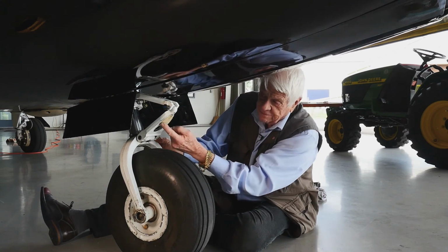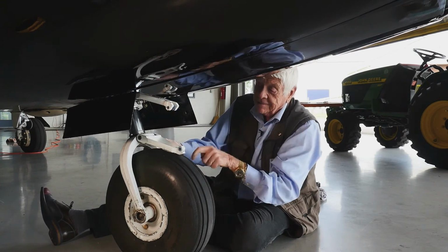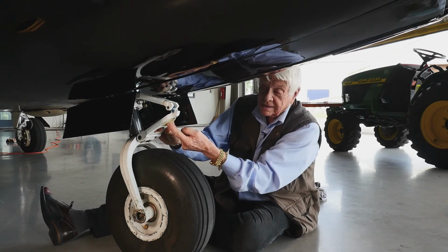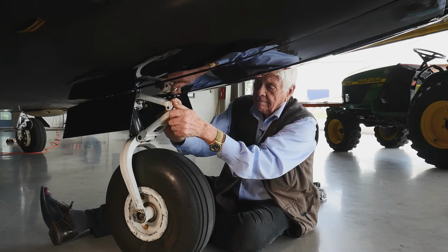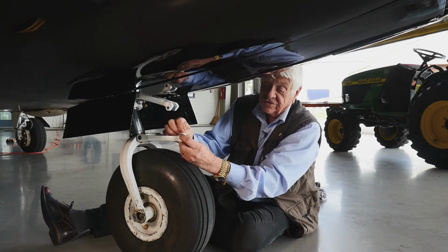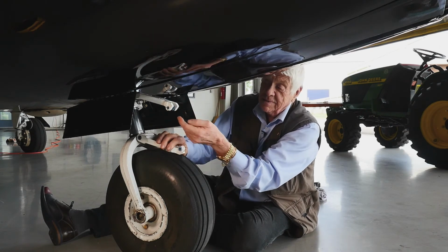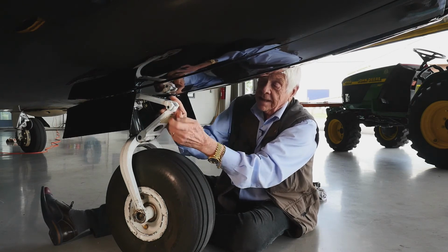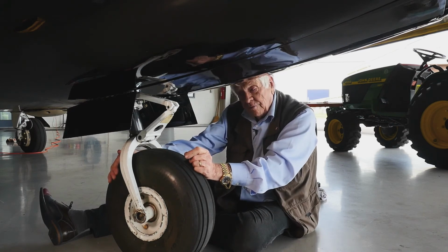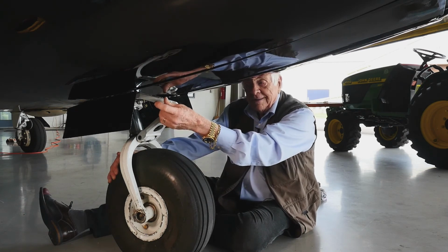Now we put a pad of Thor tape on the bottom link here, because when this bottom link falls down, it's going to run on the tire. This basically prevents the tire from wearing the bottom torque link. We've actually made these bushings as long as possible. We made them longer than the OEM ones. Of course, you've only got a certain amount of space there, but that's so we have the maximum load-bearing capability for these bearings. The material's called Aerotough. It's what we make. Our parent makes it for Marsh Brothers Aviation. It's only made for aircraft, and it's an amazing product.